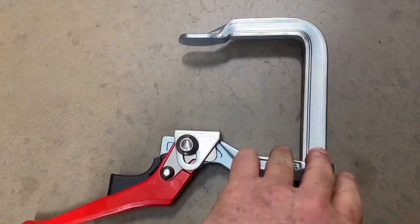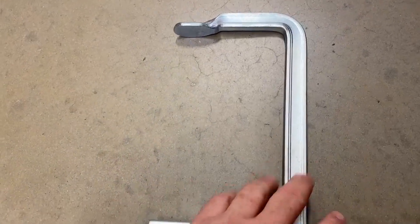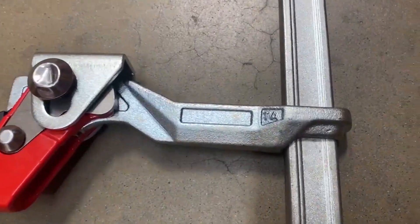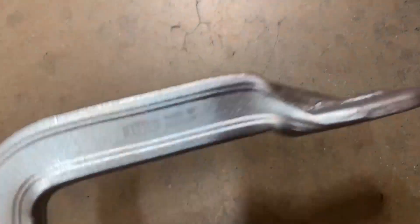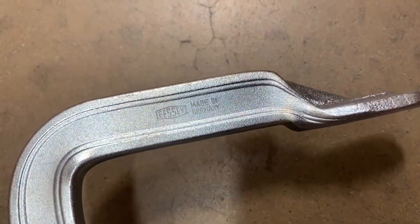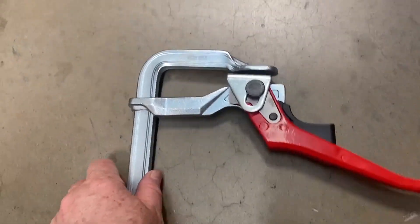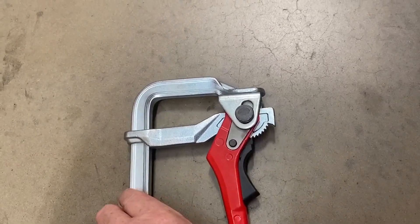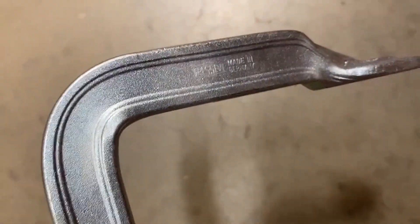It is just a thing of beauty and precision. You just snick that up and a pull, and it can exert phenomenal force — 8,000 newtons of force. So this thing is not vibrating loose. That arm is made of a single piece of cold-drawn steel, which is then drop-forged to make it super strong, then galvanized.